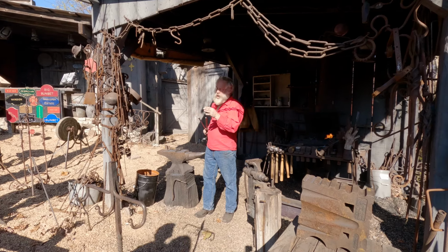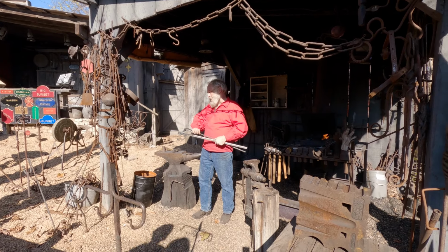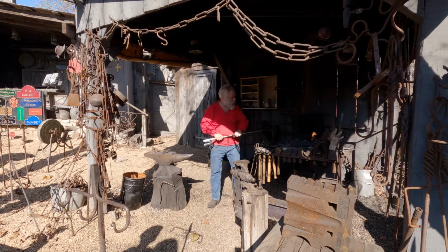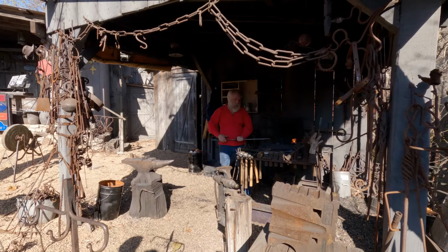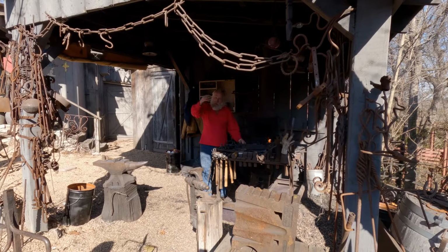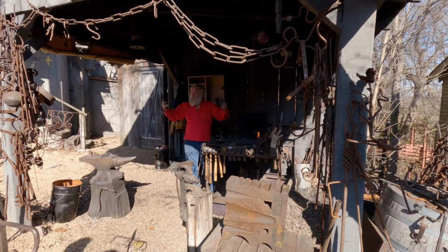I have to point the feet, and I'm gonna put the twists in. So I'm gonna lay them in the fire just like this. Line them up. They'll all heat at the same spot, to about the same temperature. And as long as I put it in the vise below the heat and twist above it, they'll all be the same twist in the same place.